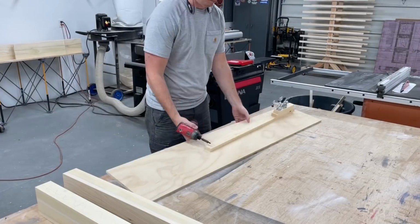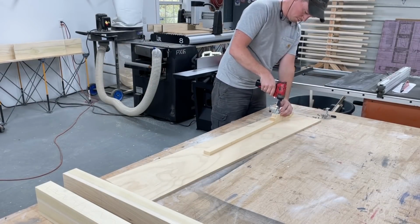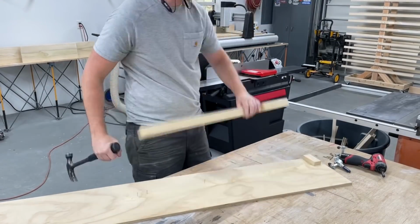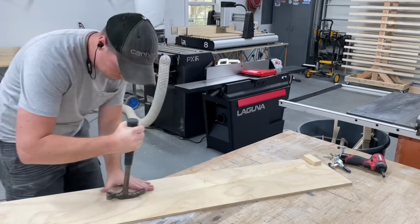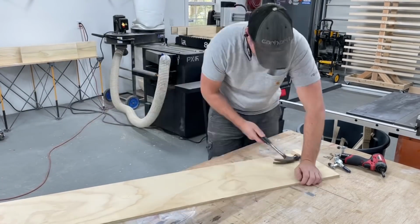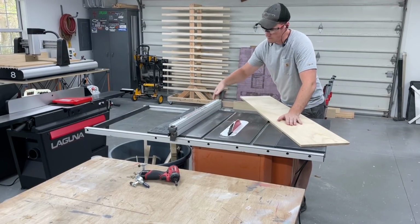I knew this project was on the docket, so I saved my quick and dirty tapering jig from the other builds, except on this one the tapers were much longer so the fence and clamps needed to be adjusted. The pieces were just brad nailed on, so I simply unscrewed the clamps and then pried them off. Then I took the plywood and made a new cut edge on the table saw.